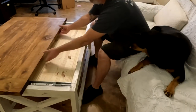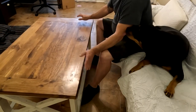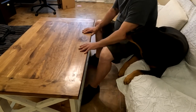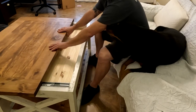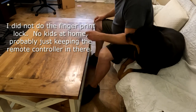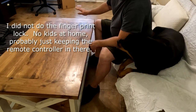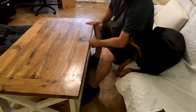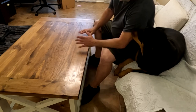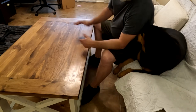When I close it — if you watch, he does the same thing — when I pull it this way, my soft close kind of catches on me. I pick up a little bit and it pulls the rest of the way shut. So it's not a thousand percent perfect. It could have been something I did wrong, but it works — it functions. Don't use soft close hinges. His cut list was pretty much spot on; I didn't have to change anything on his cut list besides what I screwed up. All the dimensions fit, all the widths fit. Can't complain.